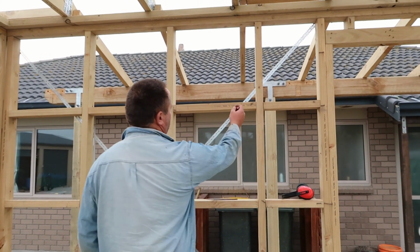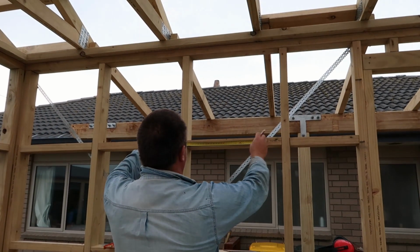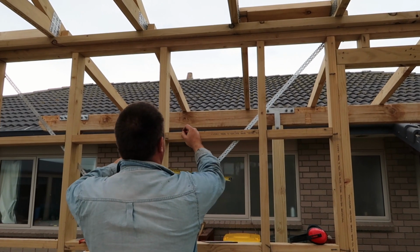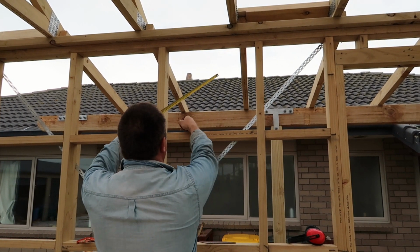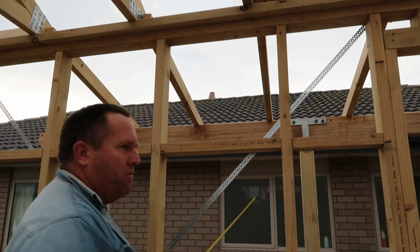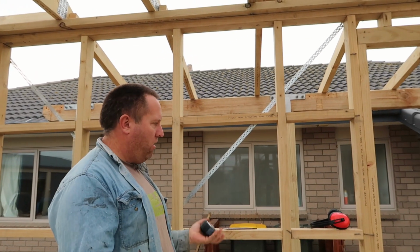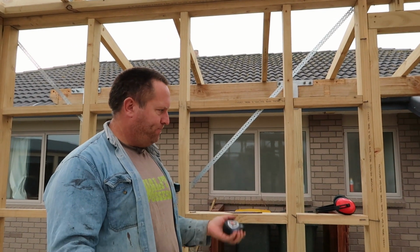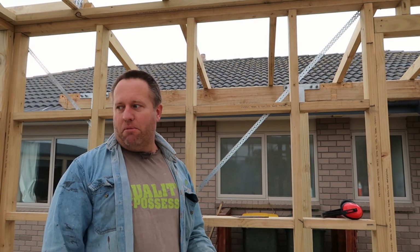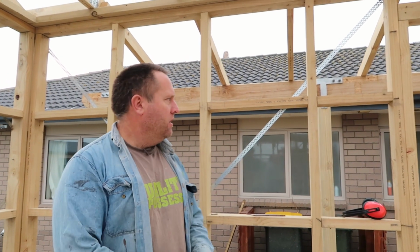So I found the centre of where I want my heat pump, and I'm going to go 400, that's the edge there. I'm going to go about 350 from the centre, that's where I'm going to have my drain, and I'm going to be coming out from below. From the pipes you can always pump it, but pumps are really expensive. I can't get them cheap, so you don't want to use a pump if you can help it. So this is how I would get my fall on my pipe and get around the edges. So let's do that now.